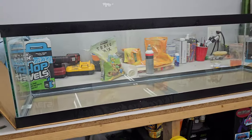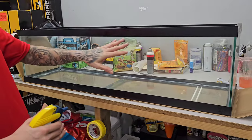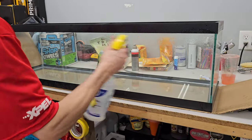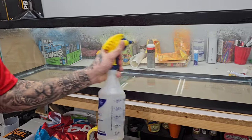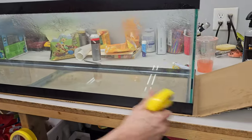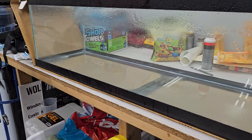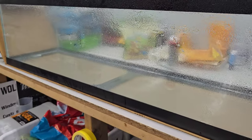Alright, now we'll use our gel. This is basically just to hold any contaminations. Instead of water seeping down, I use gel. Not like hair gel or anything like that. It's actual window film application gel. So we'll put that on around the edges, just because there's a lot of dust that can come out of these. Spray our window. Soapy water, baby shampoo and water.